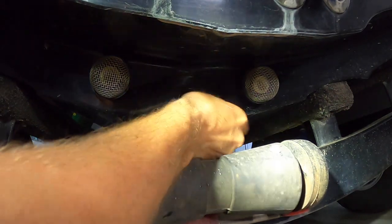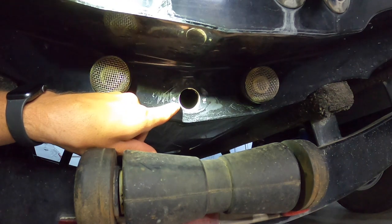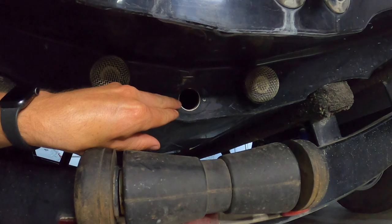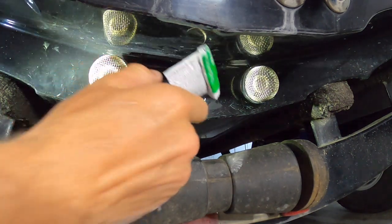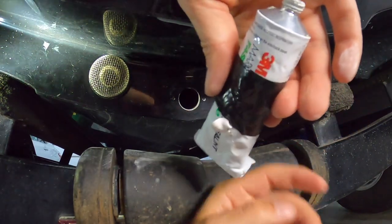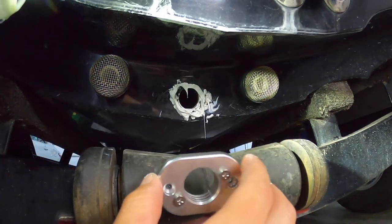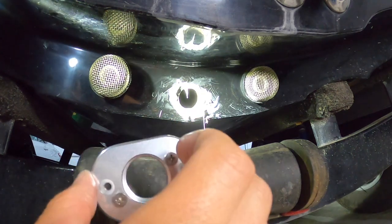Now I'm going to clean this up — I'll put some isopropyl rubbing alcohol on here, and then we'll go ahead and get the adapter glued on there. If you do not have a Phoenix, this would be the time that you just go ahead and put your regular Flow-Rite piece in here. But since we have a bigger hole here than what the remote drain plug needs, we have to put our adapter plate in first. Now it's time to put our 3M 4200 on around this hole. In an ideal world, you're going to want to use the tip, but this tube is a little bit older and it blew out on the side. That's what I'm going to be working with today.